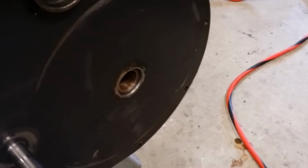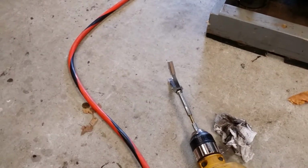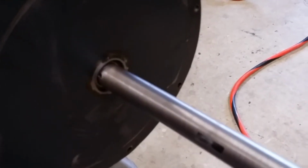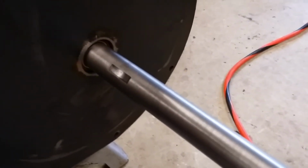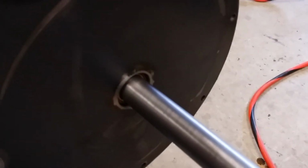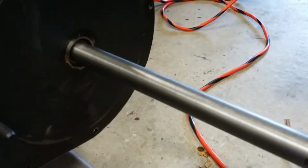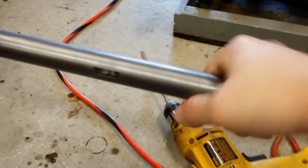All right, I just got done doing the bushing on this side with the brake hone, and it seems to work quite good. Just line it up. You can see by the Woodruff key that it is sliding in. There is some chatter only because the bushing is dry. There, you heard that little tunk? I'm hitting the bushing on the opposing side because I haven't honed that out yet. But as you can tell, it doesn't really need a lot of force to spin.